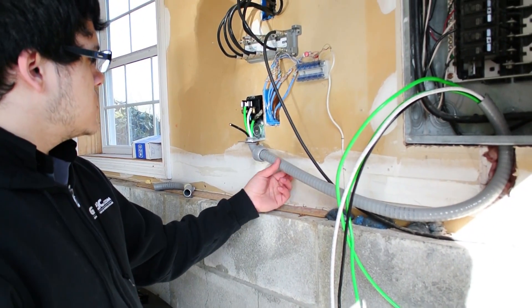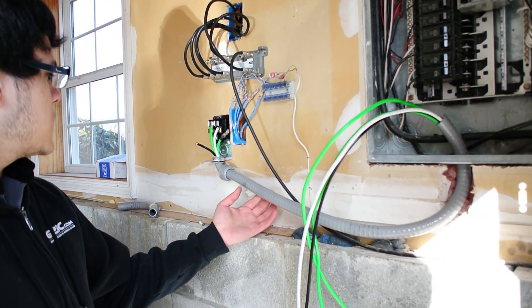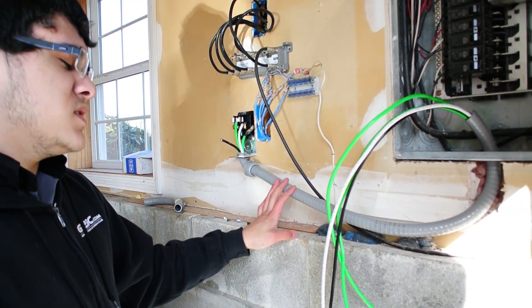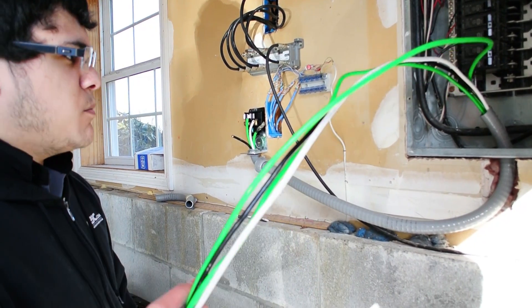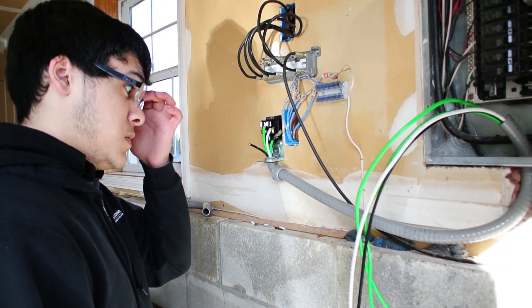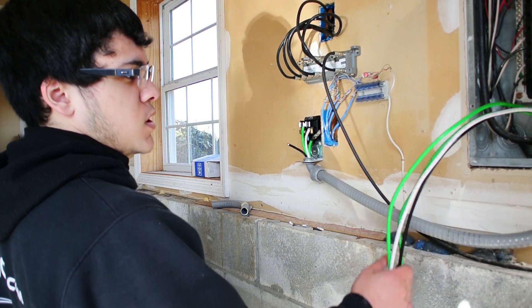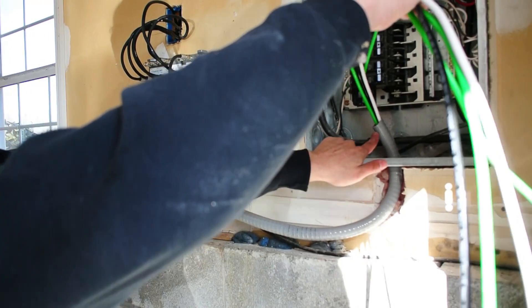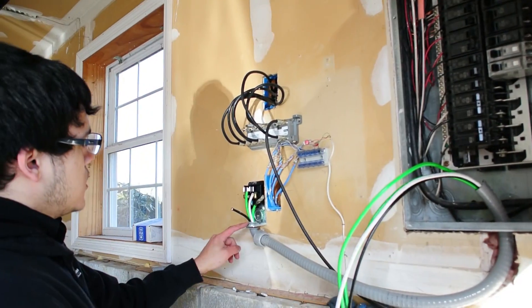This is just some outdoor weatherproof conduit. I use this instead of regular conduit because that requires bending and cutting. It's basically just so you don't have bare wires running against the wall that are carrying high current. The wires are run into the box through this conduit, through one of the push-out slots, and they're run up to our plug right here.